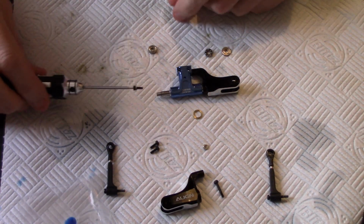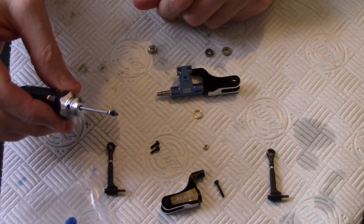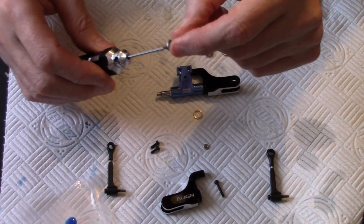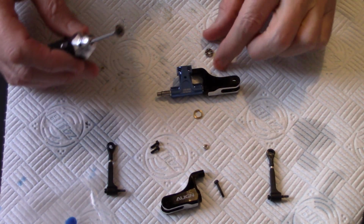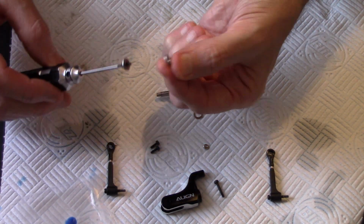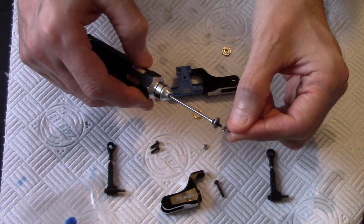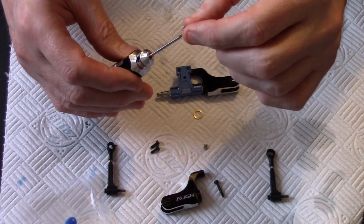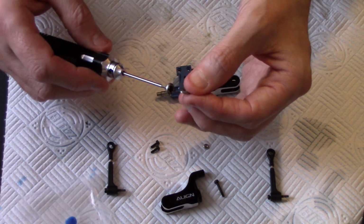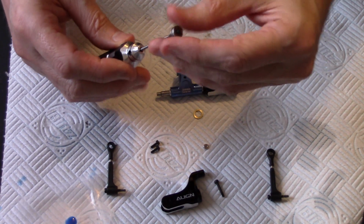And we're back. Right, where was I? I've greased up this side of the thrust bearing, put the screw on the little hex, and like I said, this time onto the screw first. You want the out one because it's going to be on the outside. Making sure you get your bearing facing the right way, so this time your ball bearings, the flat side again facing down towards the ground, shall we say, and then your inside piece goes straight onto the next part of the screw.